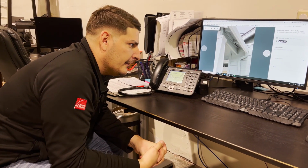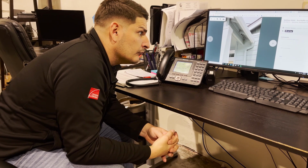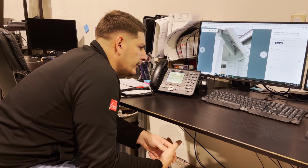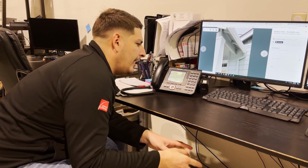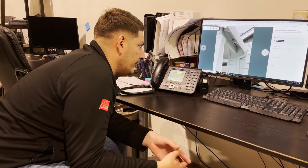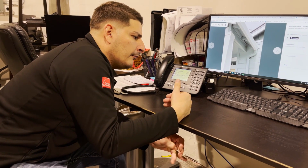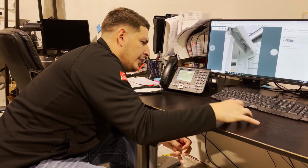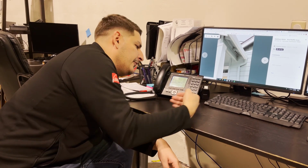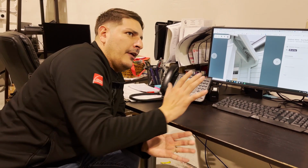Right, and so what I don't understand is where is the inflow supposed to be? Are they supposed to have soffit vents? It's usually so you want your air as close as you can to the eave, right? So now you can put the blocking in, and then you have a baffle, okay? Or, if we were going to come in and put the strips, the smart venting, we would go right below to where, and then probably up 6 inches above the ventilation. That way the ventilation is kind of out of the way a little bit.